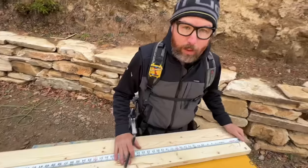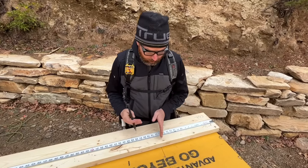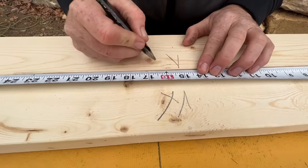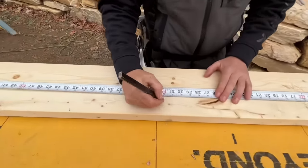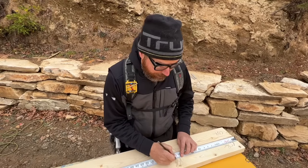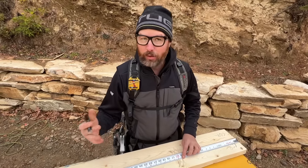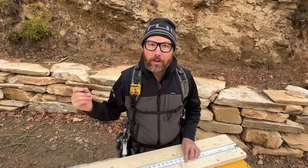There are a lot of ways you could mark the layout. I'm hooking on the end — that's the complete end of the structure — and we're going to want a stud centered on 16. You could mark one side with an X, or mark both sides with an X in the middle and three-quarters on each side. Or you could mark center and eyeball the stud to center. I like to mark the edge so you can see it better. I've heard it called 'set ahead' — you mark there and the stud is set ahead. There are a lot of ways to say it or do it. As long as we see a mark and an X, we know it's a stud.